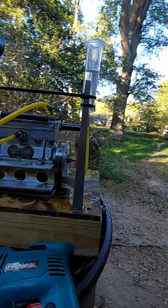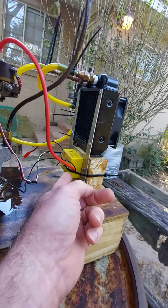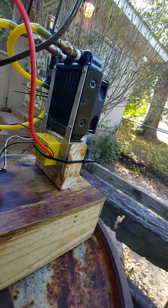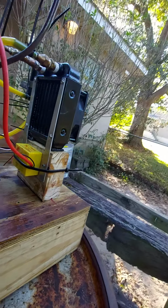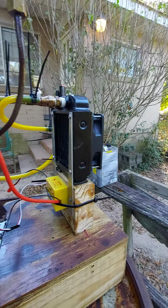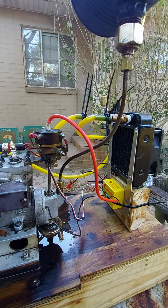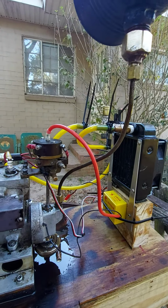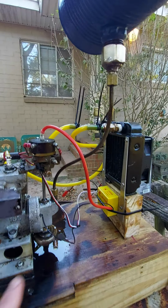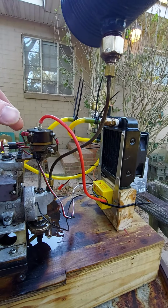Not bad for an engine that's 70 years old, running off of, I don't know what brand it is, but I ordered it through Sterling Kit, and I bought a distributor from sterlingkit.com, but I took what you would call a rotor button. It's got the four magnets in it. Drilled the hole to match that shaft and put it on the shaft